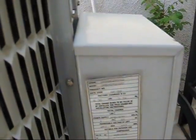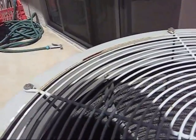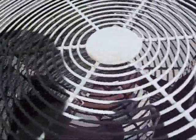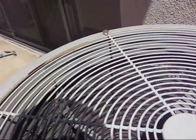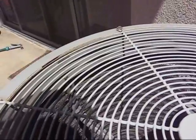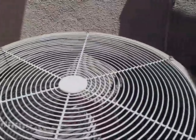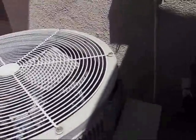That's the 38E in the model number. From what I heard, while it worked great for a straight cool unit like this one, Carrier had a lot of problems with using their spine fins on heat pumps due to water shedding. Because of the design, they didn't defrost as well, but they worked great for their straight cooling unit.